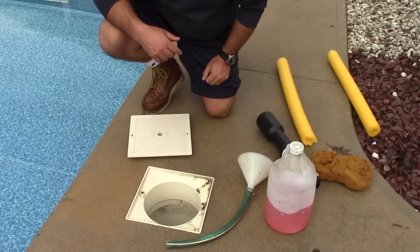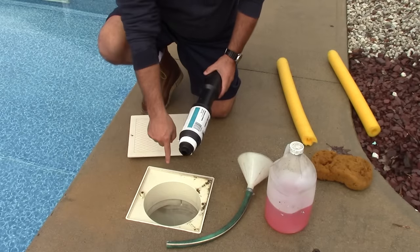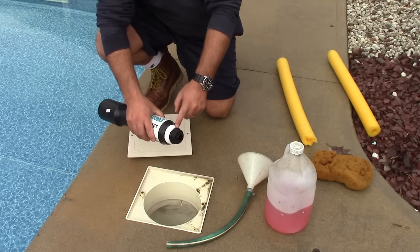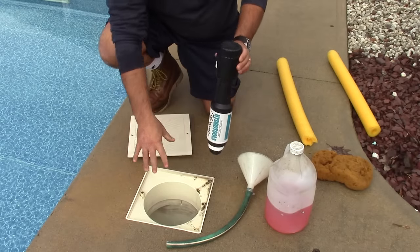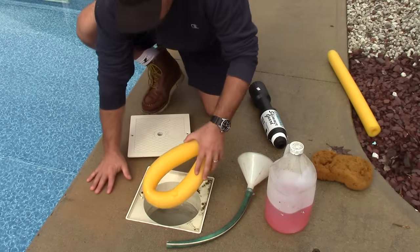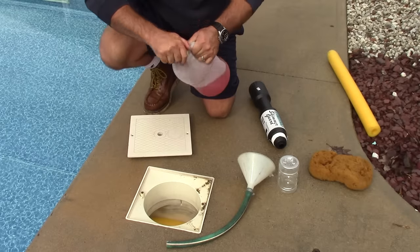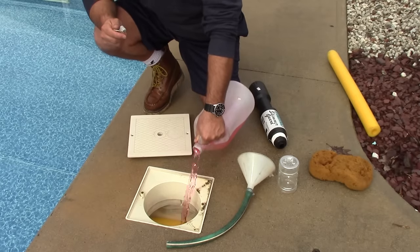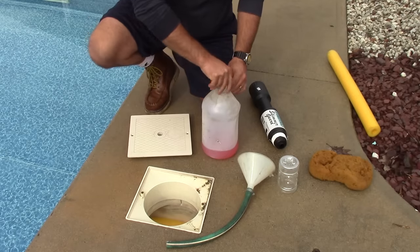You can also use a gizmo — I use this on my other skimmer. You should use Teflon tape and a rubber o-ring — very important. This works the same way: when the ice compacts, it will squeeze in and protect the outside of the skimmer box. I also put an old pool noodle in here as a preventative measure — that'll compress if there's ice. And finally, my third bit of insurance is to put about a third of a bottle of antifreeze in here so it mixes with any water that settles in there.